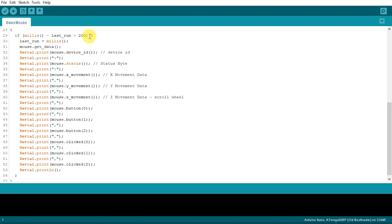In the main program loop, we call the getData method on a regular basis. I've set up this test program to do that every 200 milliseconds so we can better see the mouse data as it scrolls up our serial terminal display. If you use long periods between mouse reads, you'll find that movement data can get clipped. The internal counters within the mouse are stored as 9-bit signed integers, giving them a maximum value of plus or minus 255. So if the mouse moves more than this between reads, it will send back the maximum value and also set an overflow bit in its status register.